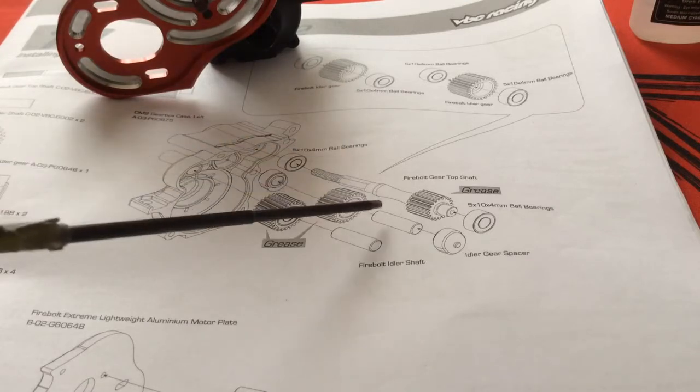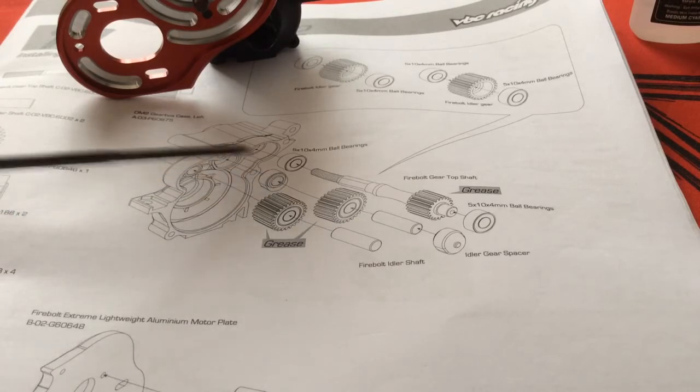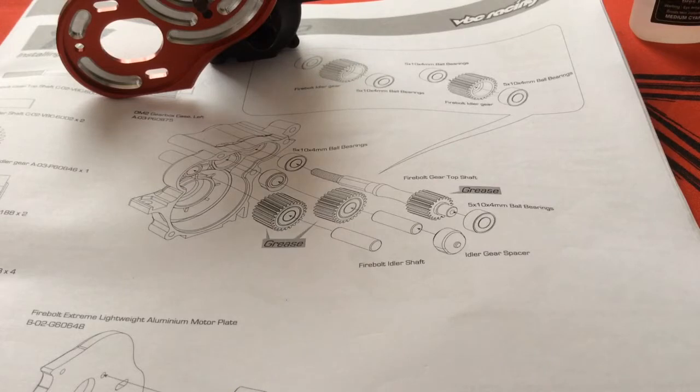I also took these pins here and placed them in their respective holes. I noticed there was a bit of slop in where the pins would be positioned. So I thought, well, if I glued the inserts in and it's nice and secure, I might as well go ahead and glue the actual pins in. I cleaned them with some motor spray and scuffed the one side of the pins that will be going into the hole locations and being CA'd. The thing is, I CA'd the pins in, but if something happens and I need to remove the pins, all I need to do is take a pair of pliers and gently twist on the pin and the CA will crack and you can pull out the pin and do whatever maintenance you want.